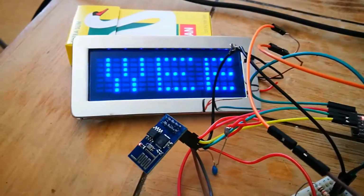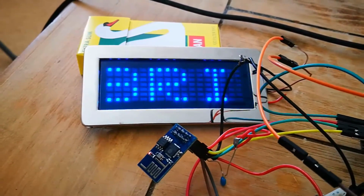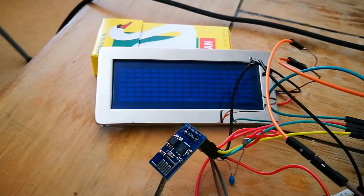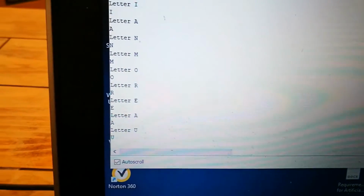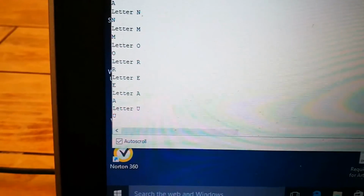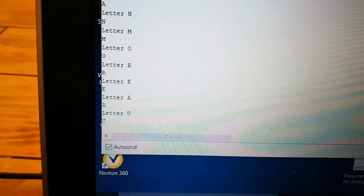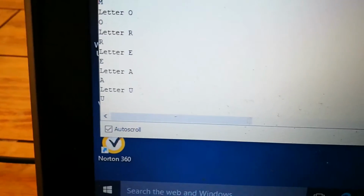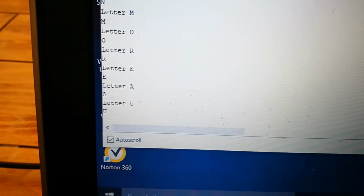So now it's programmed in the message. Oddly, the first letter of every message is wrong. That should say tweet me, not sweet me. So now I'm using an Arduino timer, and I've set up a timer so that after 5 minutes it will connect to Twitter and receive a tweet, and then display the tweet on the LED belt buckle display.